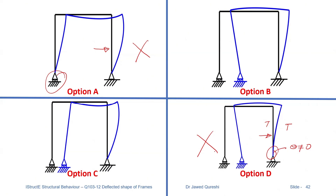This leaves me with option B and C. When you apply loading over here, it is moving the column towards right, but it should move the beam up in a way so that there is tension over here. I don't see a reason for sagging in the beam — sagging cannot happen because no vertical load is applied. So that option is wrong. The correct option is option B because when we apply loading towards right, tension should be outside. The column with roller should not bend, and there should be single curvature tension outside in the beam.